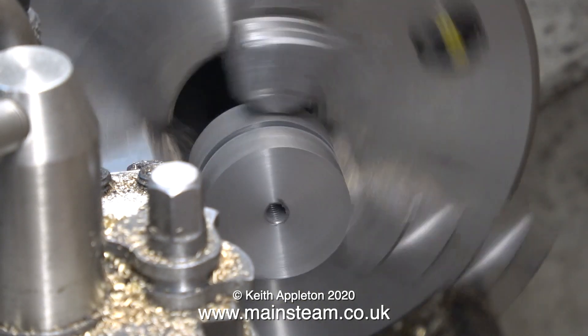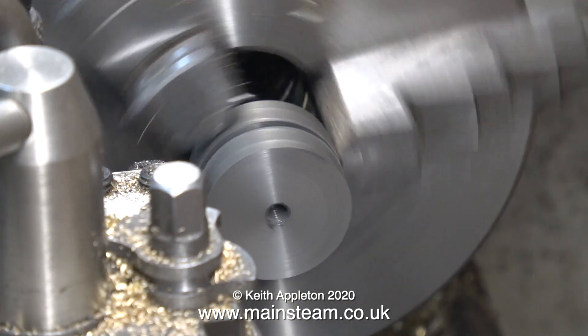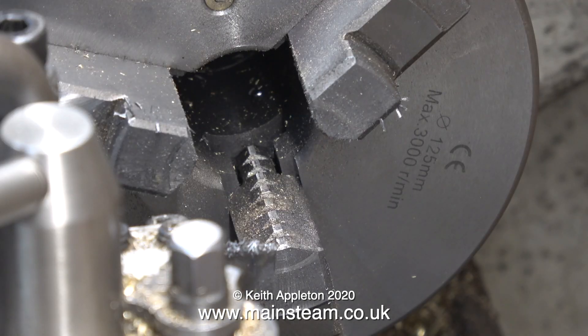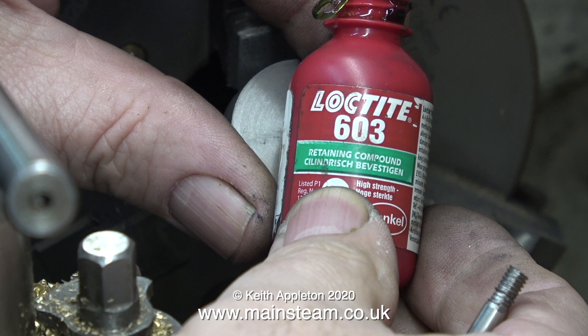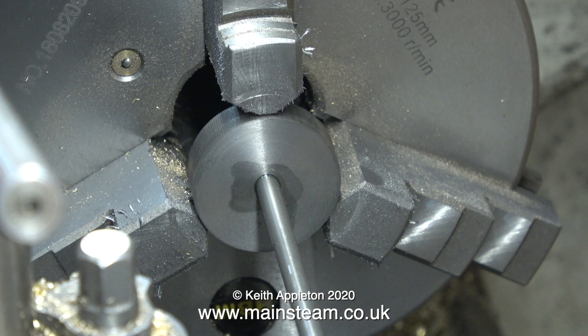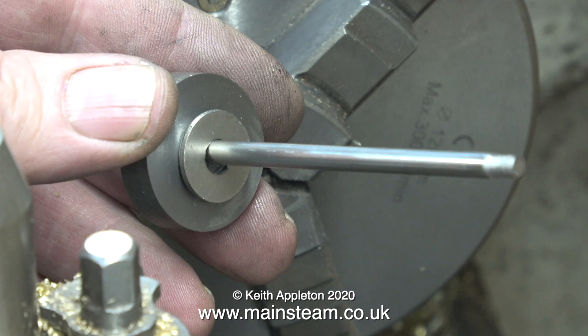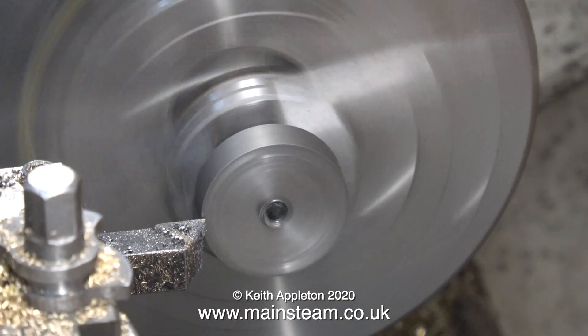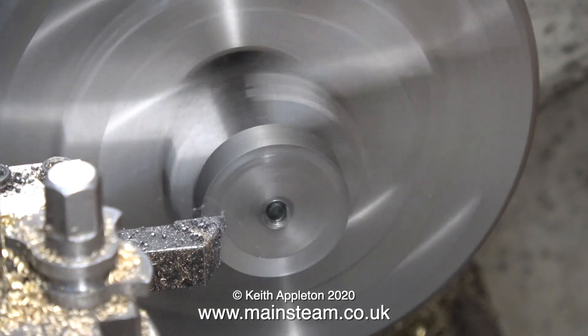In this parting-off sequence the piston blank has become wobbly — it's wobbling because I pulled the part out of the chuck so the parting tool holder cleared the chuck jaws. The next part of the job involves some Loctite 603. I must say that this piston and rod assembly is nothing like it's shown on the drawing. If you're building one of these engines, it's your choice — make it like the drawing, that'll be fine; make it like this, it will also be fine. By holding the piston blank in the chuck and the piston rod in the tailstock chuck, I tighten the rod into the piston blank. Put a couple of washers behind the piston blank so when it's up against the chuck jaws the lathe tool will not collide with the chuck when you machine the outside diameter.